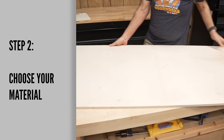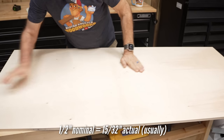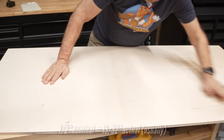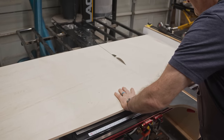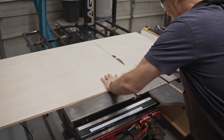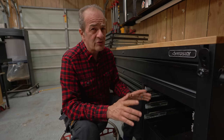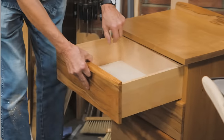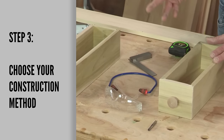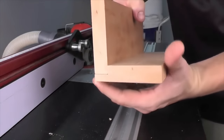I started with a sheet of half-inch Baltic birch plywood. There's really no need to go with anything thicker than half an inch. I probably could have gone with any kind of sheet goods, but I wanted something that would be flat and dimensionally stable. With this build I knew that precision would be important, and any wood movement would mean the drawers would likely stick — and I definitely don't want to be dealing with that.